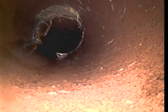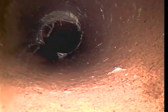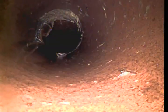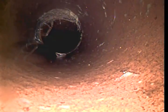Another little separation there. This one's a little troubling looking with the roots that you can see at the top of the pipe there. They don't really fall in line with the seam of the pipe. We might have a little section there broken out, but no chunks of pipe sitting in there, which with the water we've run here I wouldn't expect to see. Here's a pretty healthy root intrusion, pretty decent separation there, probably about an inch to a half inch. Pretty easy for the roots to get in there. That was at about 59 feet back from the sewer line.